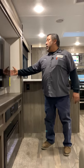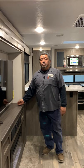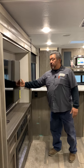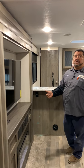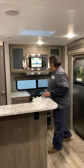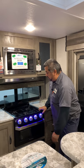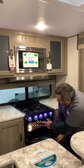The TV here is going to have a remote. You're going to have to scan it for every place you go. On these newer trailers they're not going to have an antenna that cranks up unless you add one, but they do have a regular antenna with a booster — you're going to have to turn the booster on to get the signal to come in. Up in the sink area, once you get the propane on, you want to light one of the top three burners to get the air out of the lines.